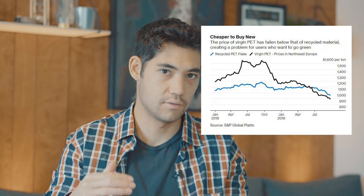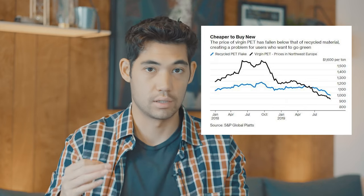How much is one ton of polypropylene worth? Right now I think polypropylene is sitting at $1,200 US dollars per ton. It does fluctuate just like gas and petrol because plastic is a petroleum-based product. Interestingly, you have virgin plastic material and also PCR or recycled plastic material — both fluctuating at different rates. Generally the virgin plastic material fluctuates less over a long period of time, so it's easier to calculate costs for your inventory. That's why a lot of companies choose not to use recycled material even though most consumers would want them to — it's a little harder to gauge what those prices are going to be. Also, recycled material generally tends to be a little more expensive.